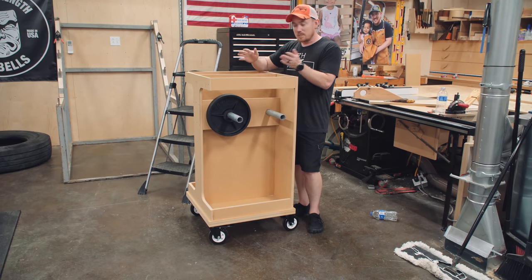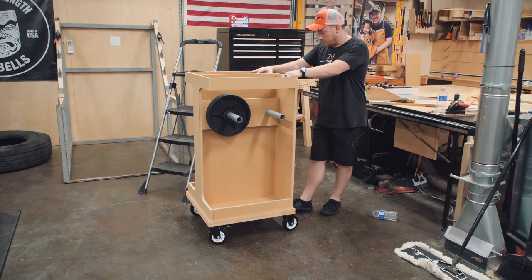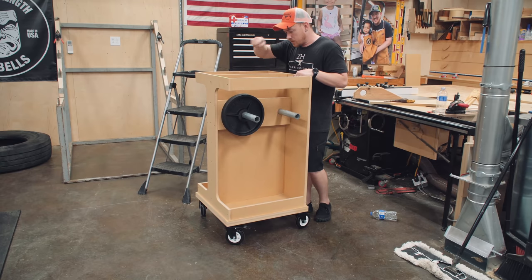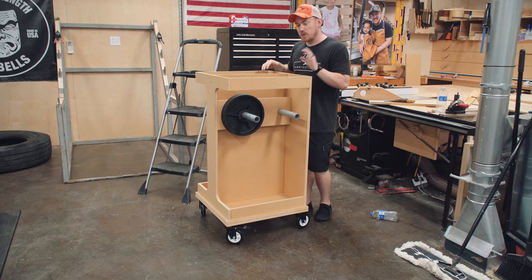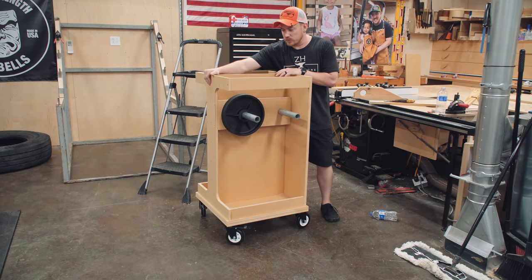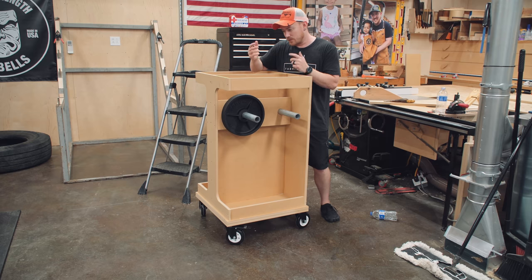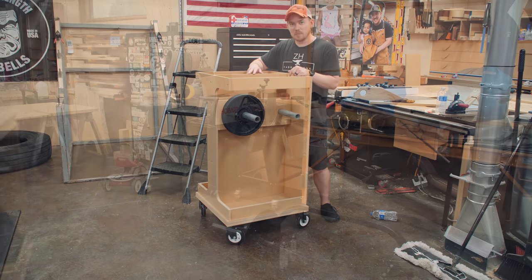So I'm going and pin nailed, not brad nailed, but pin nailed. I think because the bottom is attached around the perimeter that it should remain stationary. I'm going to try to remove the screws and break the internal MDF free, spin it around 180 degrees, hopefully get a little bit of glue in the joint, re-screw it back together, and hope it's gonna be all right. I think it'll be all right, but man, I goofed up.